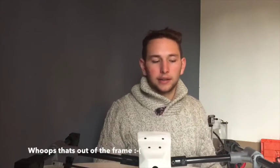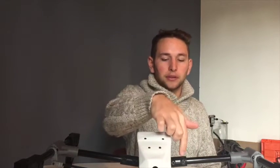I also realized that when I inserted my side arms, I didn't notice there was still some support from the 3D print left inside there. The measurement was off, so when I put these little arm linkages on it didn't work as I thought it would. It took me a while to figure out that was actually the problem, even pushing as hard as I could. It was a little piece hiding — actually on both of them — on these arm raise parts here.